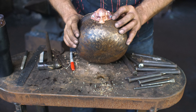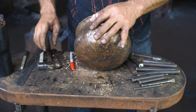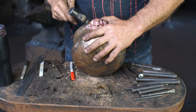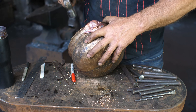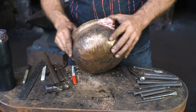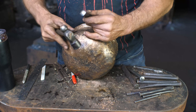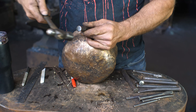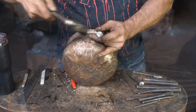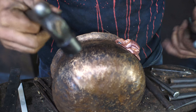So I have bolted my two copper skulls on either side just to get them temporarily in place. Now that they're bolted on, I annealed them just prior to this so they are super soft. Now I can just tap everything in and get it to conform very nice and tight around the profile. Also what I'm going to do now is pop a hole through here for the ring — just massaging up the opening so that it rounds out nicely. This is one of the instances where it's actually good to have a big giant beer gut because you've got a nice organic tool rest to push against.